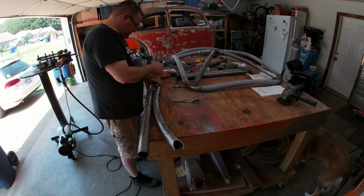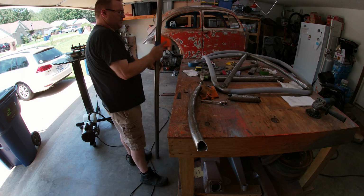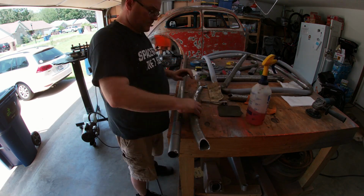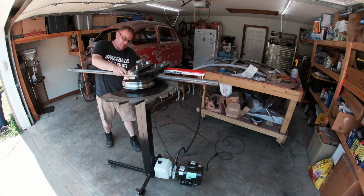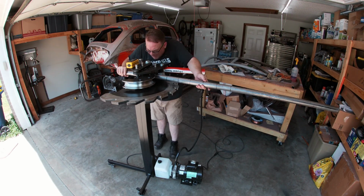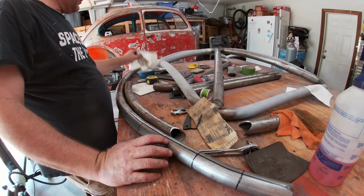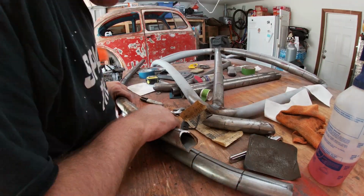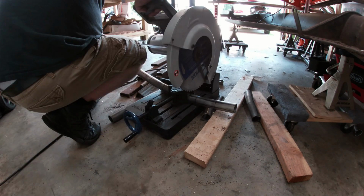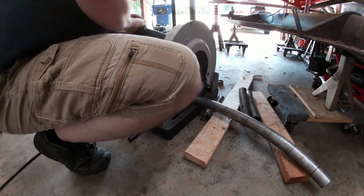Once the first tube was coped and ready, I used it as a template to make the second one. While the first A pillar to B pillar tubes were quite shallow in the bends, these diagonals have the tightest bends, or about 5 degrees every 4 inches. I was sure to make this piece long enough, not just to supply me with the piece for the B and C pillar, but also for the little shorties behind the C-pillar as well. Then everything got trimmed to length and I started coping the tubes.